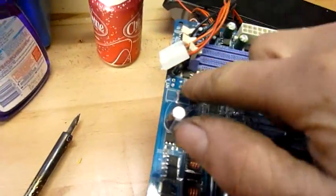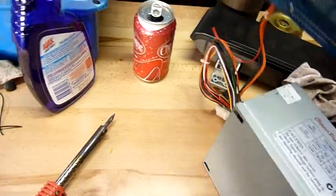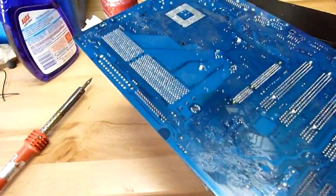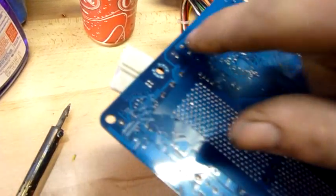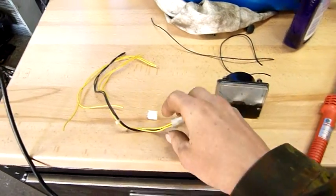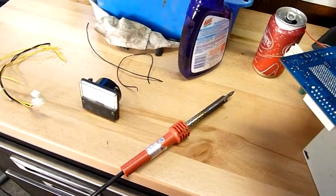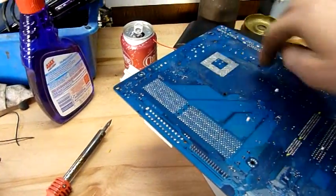You'll notice they're combined on the board. We're not going to be combining negative through anything, we're just going to be combining the positive side. So positive DC is there, and you can see the pads joined together, so I'm going to bridge across the pins. Typically they all come from the same supply rail, although the power supply on my other computer has a secondary 12 volt supply just for feeding the CPU's regulators.